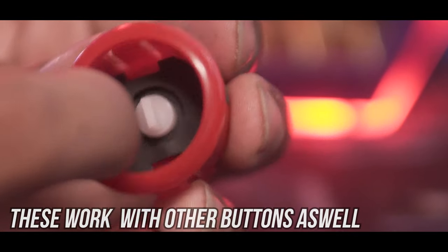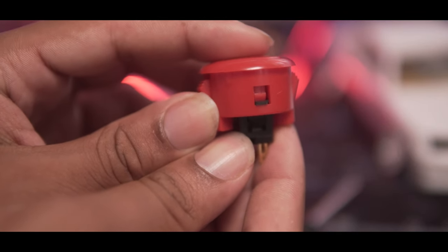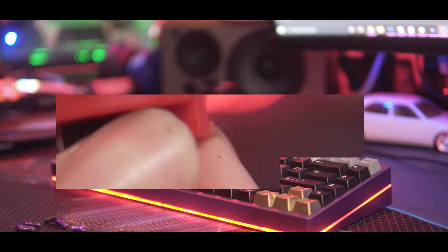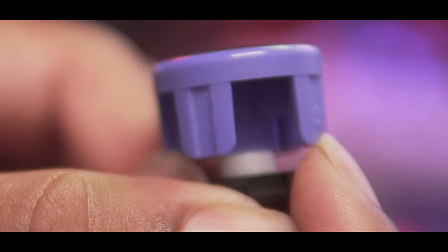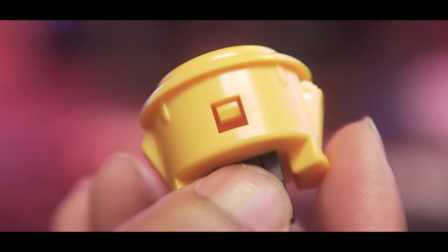Although the click and clack of the arcade button is now silent, it unfortunately gave the button a mushy feeling when you bottom out, since you're just jamming the plunger into the silent pad. In response to this, Sanwa released the OBSF silent buttons, which feel the most different — the plunger, aka the face of the button, is designed differently with a flexible mold compared to stiff plastic. They also removed the plastic tabs from the plunger that usually hit the bottom of the housing, making it quieter as well.